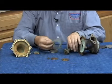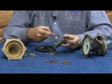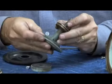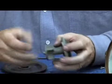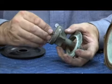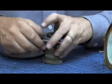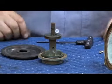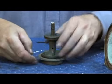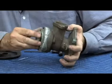First we're going to have is, of course, our relief valve seat, seat O-ring. Place our two O-rings or the quad ring, depending which version we had on the relief valve stem. Relief valve seat, relief valve disc, and our disc retainer. This being the old style, we have a bolt on the bottom, where the new style would have had a stud protruding through with a nut. Once I have it in place, make sure that sits evenly on my seat. Grab my body. Remember, I have to insert my stem in from the bottom.